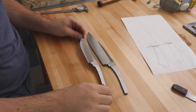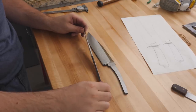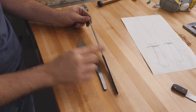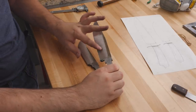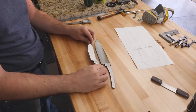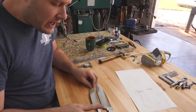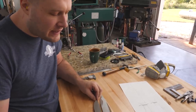Twenty minutes later, I've got the blade bevels rough ground on the fighter and the hunter. We've got about 75 thousandths thick edge on the hunter and something like 90 thousandths on the fighter. I also tried to get the grind to go up to the spine about the same distance on each side. The Damascus is looking super clean so far — I think we're ready to go ahead and stick these in the oven.